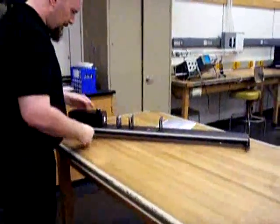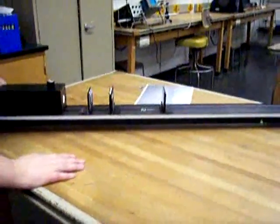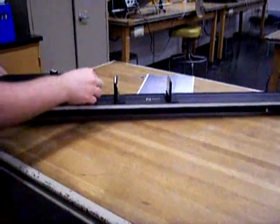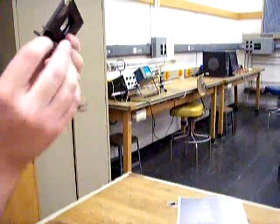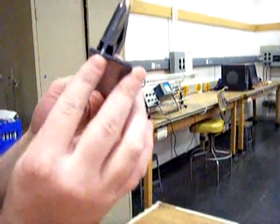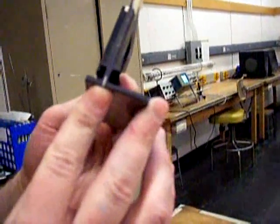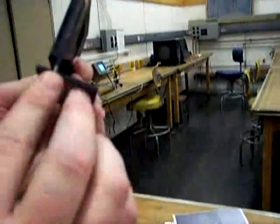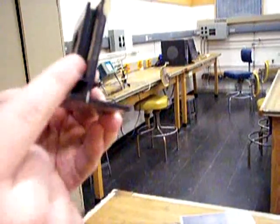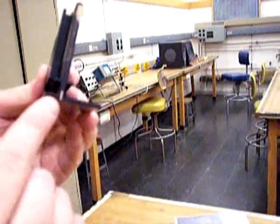Let's take a look at this. This is our setup. Each of our optical elements are mounted on these magnetic slides. And we can see here is the lens. We'll be measuring each of these with this white line that we match to the ruler taped on to the bench. And we'll notice this white line isn't exactly where the center of the lens is. So that's why we have to adjust.